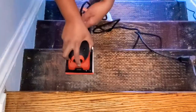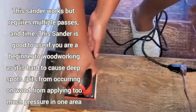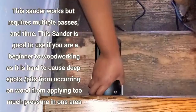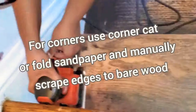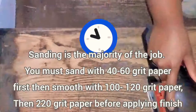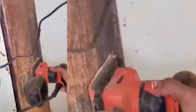The sanding portion probably took the longest just because you have to really remove all the prior stain and if it had any varnish, remove that too — with 40 to 60 grit paper. Then after you've stripped the stain off, the next step is to use 100 to 120 grit paper to get it to a smoother wood surface, then 220 for the final surface before applying a finish. The sanding process did take a long time because I used a sheet sander. A belt sander would get the job done quicker, but I opted for the sheet sander.